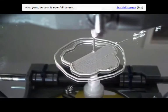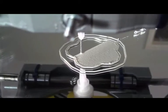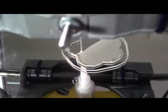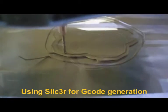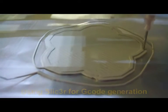This is a printer that he's built, printing with some clays and sugar materials. He ends up being able to print with chocolate. He's actually printing on a mirror, because when you're in the open source world and you need a really flat surface — mirrors are generally really flat and they work quite well for this. Throughout, he has a very long blog posting where he shows all of his research on making this system and what design decisions he made. It really boils down to a few basic things that I'll get to after the video.